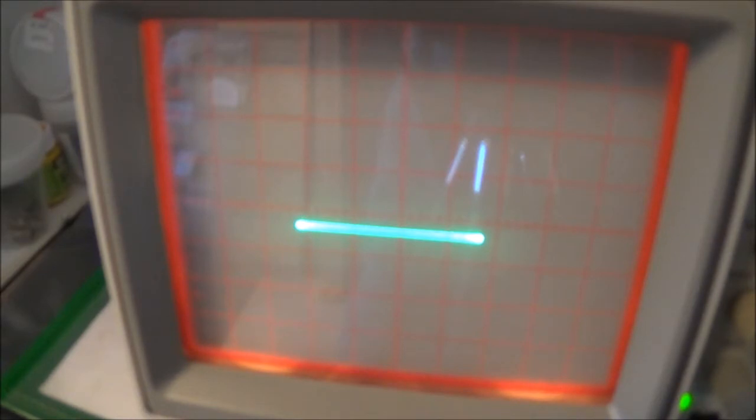In order to get Lissajous figures we have to put the scope into XY mode. As I've mentioned in past videos, the signal generator has to be pretty accurate or else your measurements are going to be off. A signal applied to the vertical input is going to make the electron beam move up and down.